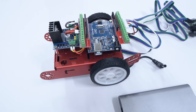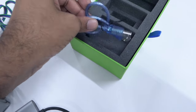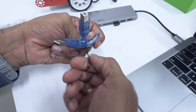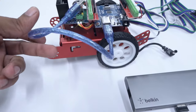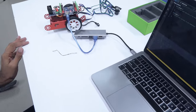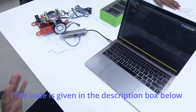Now it's time to program our robot. As you can see, the Arduino has a metal USB connector. In box 3, a cable came with the Arduino — here is where we will be making use of it. Once you take it out, you will see that it has a USB at either side. Connect one end to the Arduino and the other to your laptop. Immediately, you can see that the laptop is powering the Arduino because of the LEDs. You can open the IDE and start programming. If you do not have Arduino IDE, follow these steps: open your browser and search for Arduino IDE download, click on the very first link to get redirected, then proceed with the relevant download.